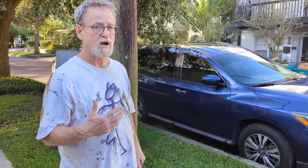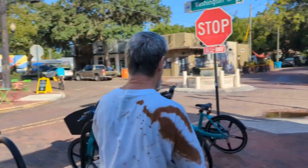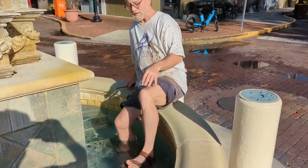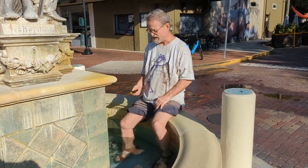We're going to close off two valves so the fountain doesn't refill, and unplug it and drain it partially the way down. So let's walk on over to the fountain. I recommend sandals for this job and old shirts because we'll be using muriatic acid in a little bit.